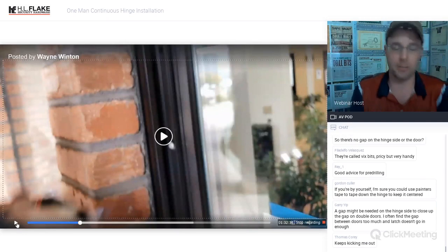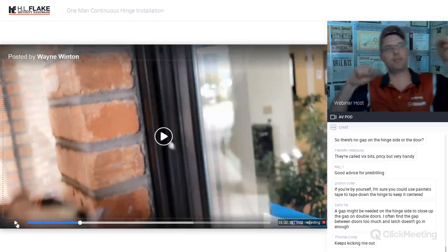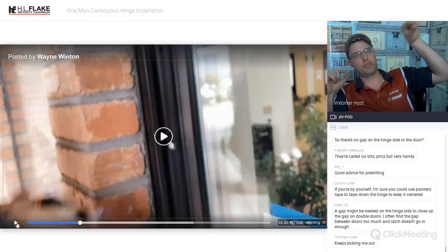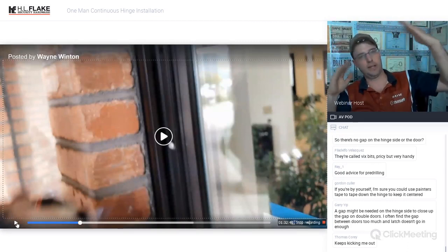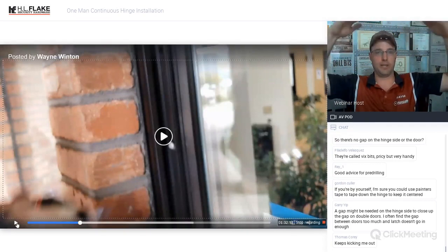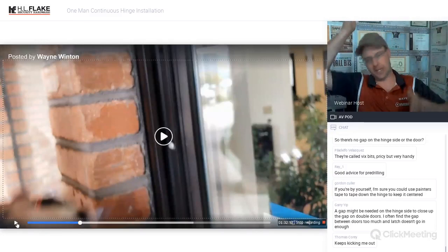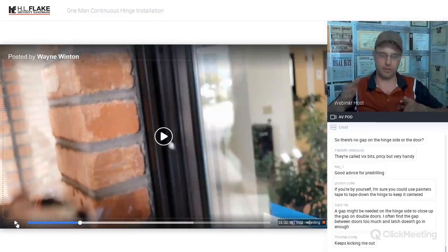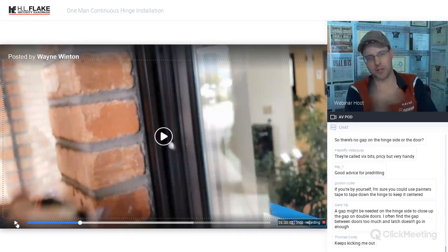Yes. And that's the perfect time to actually center it up. When you raise that door up, usually the gap will start off small on the hinge side, and it'll get bigger as it comes to meet the other door. And as you press that door up with the airbags and shim it, the shim will hold your consistent line and get that door realigned and recentered so it doesn't drag anymore. And then you bolt it into place and then you can do the final touches on the other door.